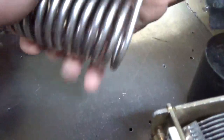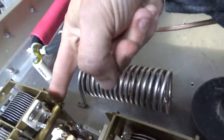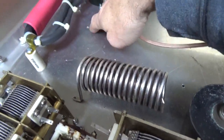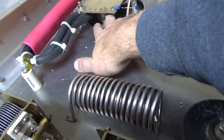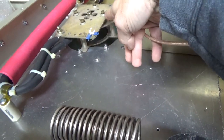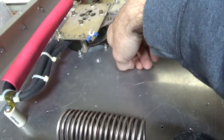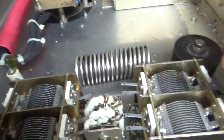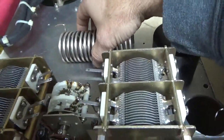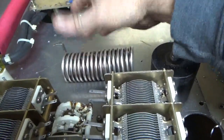I'll mount that and then I'm going to run RG-400 from over here from this connection — same with the solder tabs — and put a standoff over here. I'll put the .01 caps and may have to run it over here this way, drill a hole, solder tab, solder tab. I'm going to do the same junction setup with the .01 caps, three in each side to each side of the filament. Then I'll be at the point where I can run the straps and start from the cap down to the coil on each side and start tapping the coil to the rotary switch, and then the input circuit will be done.